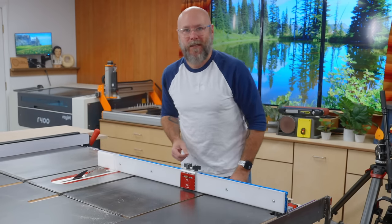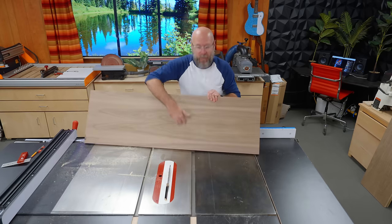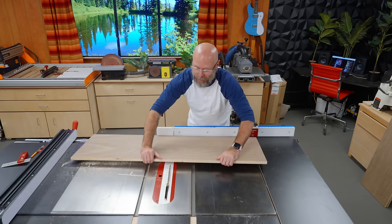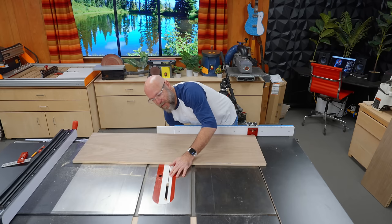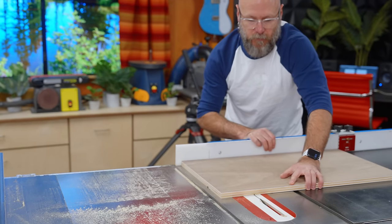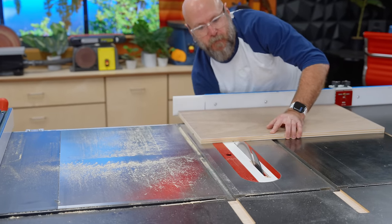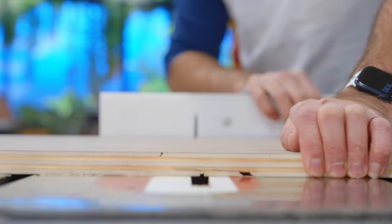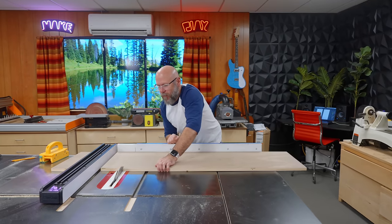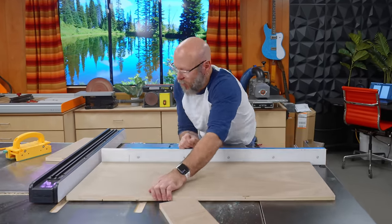In woodworking, there are multiple ways to do nearly everything. A lot of times when you're cutting against the grain on plywood on the bottom side, you'll get some gnarliness and ruin the veneer. A cool trick to get around that is: you could put a piece of tape on there to hold those fibers in place, or you can lower your blade so it just scores the piece, then raise the blade and cut through again. And look at that — a perfectly clean cut, absolutely no tear-out. I cross-cut all of those pieces just a little oversized because we're going to edge-band them.